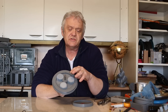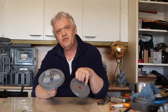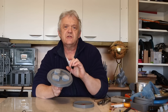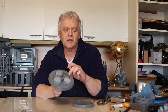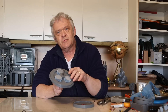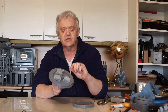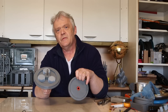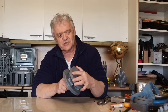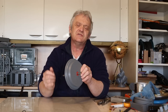Now, these teeth are a different modulus, because in order to squeeze 57 teeth directly onto 60 teeth, you can do it if you change the modulus of the tooth. The modulus reflects the size of the tooth. Normally you can only do modulus to modulus to get the gears to engage, but there's such a slight difference — this is modulus 2 and this is modulus 1.98 — that this will actually squeeze onto that really rather nicely and both gears engage.